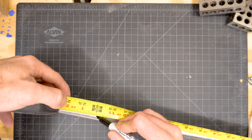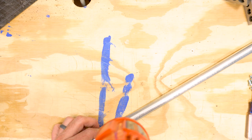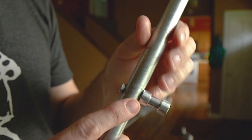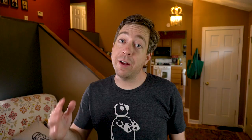After that, take the two pieces with the elbows attached, and measuring halfway down the pipe, make a mark. This is where we're going to attach that 5/8-inch stud, so it's easier to clamp onto a grip head. I drilled a small pilot hole, then a quarter-inch hole, and then attached the studs using those 1/4-by-20 screws that we had.